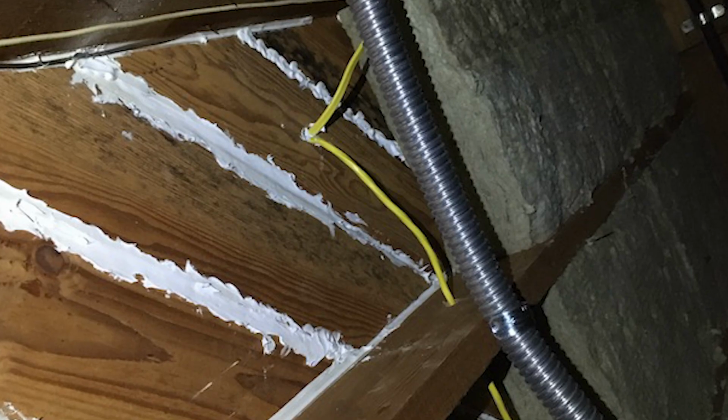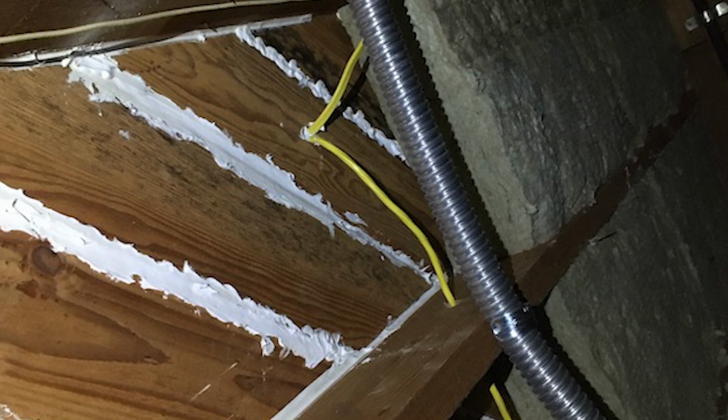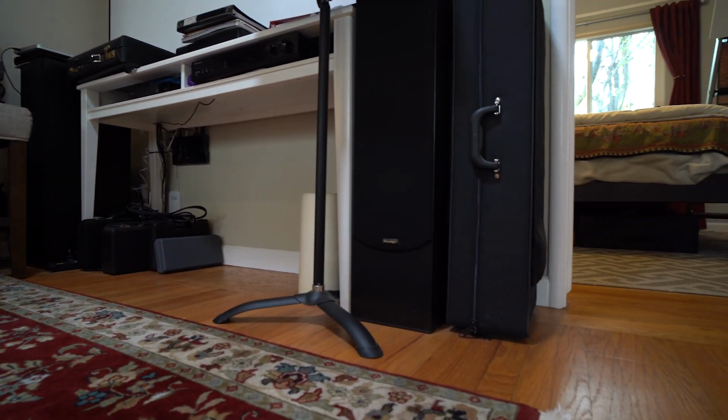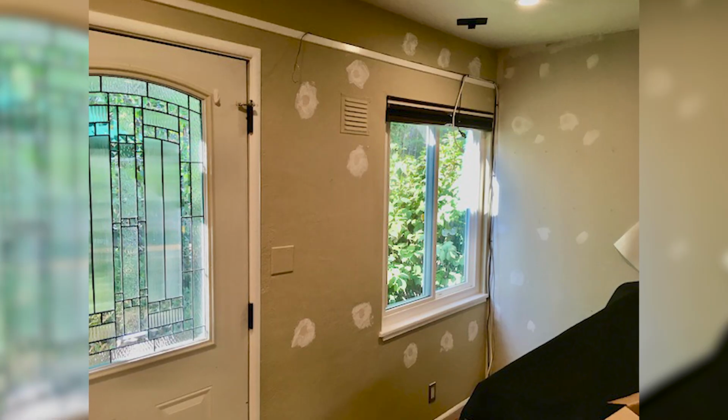After I tried to seal everything, I insulated the floor with mineral wool, which looks like fiberglass, but it's more dense and fits more tightly between the joists of the floor. All the exterior walls were insulated by drilling holes and blowing in loose fill insulation.